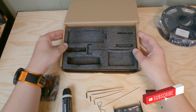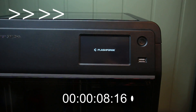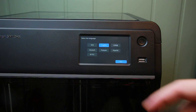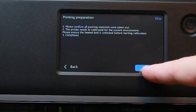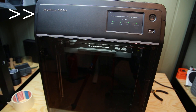We've got some extra glue to make sure our prints stick. Then we power it up — it's not the fastest boot time, actually around 18–19 seconds. Then it's time to set up the language to English. Here you want to make sure that you have removed those screws for the build plate before the machine starts calibration.